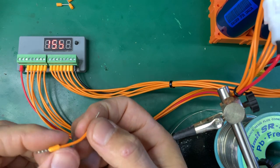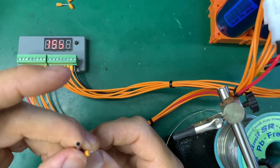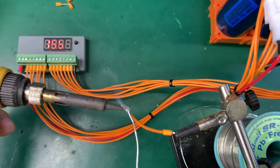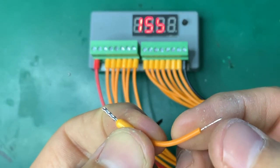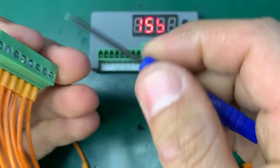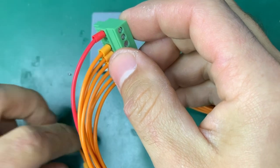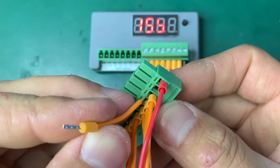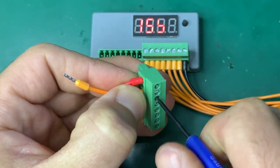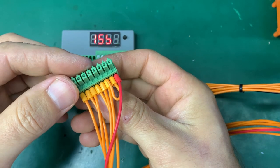You can't really squeeze two ferrules into the same screw terminal — you can either use a slightly larger size ferrule, or it's actually easier to just solder the two wires together. I pre-tin the jump lead, add a bit of solder to make it stronger, then remove the connector and insert from the bottom. I hold it in position and screw it together — then connect the other end normally, giving a short between 13 and 14.